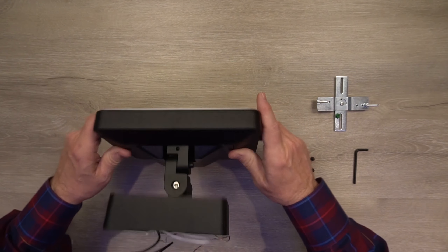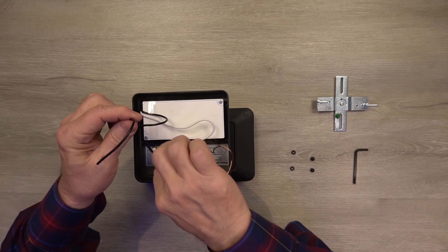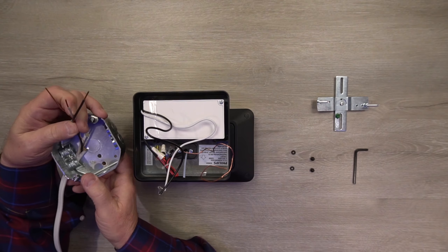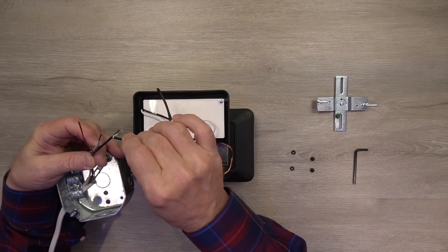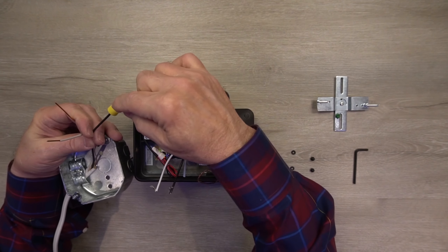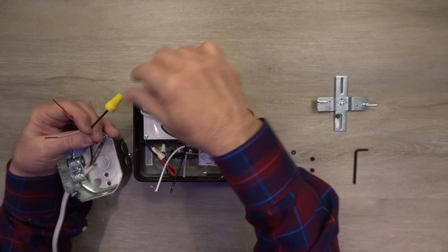The wiring is done inside the enclosure on the other end, and you'll find a ground wire, a black wire, and a white wire. Before you ever start wiring, make sure you turn off the breaker and verify that the power has been turned off. Inside most 4-inch electrical boxes you'll find corresponding colored wires. Simply connect ground to ground, black to black, and white to white using a wire nut — put both wires together and twist it on nice and tight. Once it's tight, take some electrical tape and tape it to the wire to prevent it from backing off.